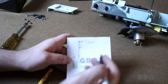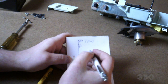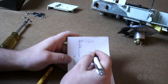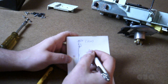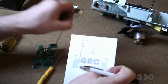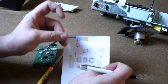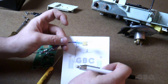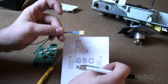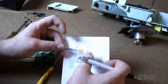In this circuit I'm only going to use the sweeper lead and one leg of the resistor — not the full three-terminal voltage divider configuration. You have your typical resistor and then the sweeper, which is the arrow, and we're only going to use one leg and the sweeper. That's how I have this one wired. This is a 500 kilohm multi-turn potentiometer and I just need to hook it in in place of the original resistor, then take it up to the car and adjust it to match the other tachometer.